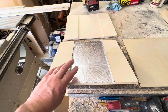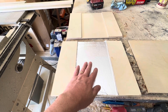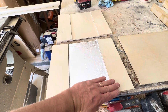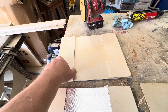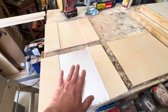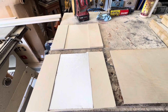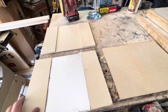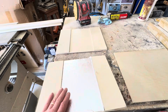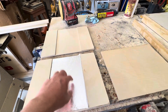This right here is some foil tape, used in areas with heat — meant for furnaces and similar applications. I put this flat part down so the solar panel would sit on top. Then there's one that's just quarter-inch plywood standoffs. I'm going to attach these to the panel, put them out in the sun, and take temperature measurements on the top of the panel and on the bottom — an analog for the inside of the camper — to see which scenario stays coolest.